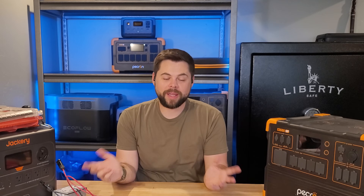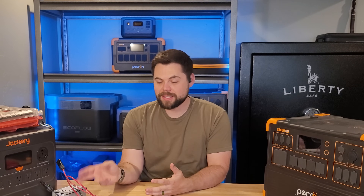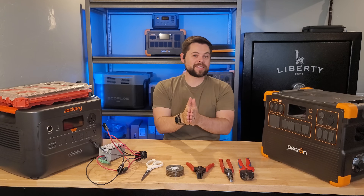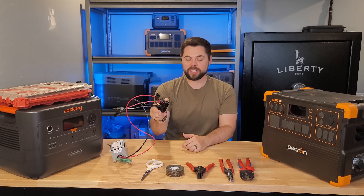This video is not sponsored in any way. If you use the links in the description below, you'll get coupons and discounts on the EMP Shields — those are affiliate links that also help out the channel. The exception to all of this is units like the Jackery, which use a proprietary 8mm barrel connector. Because the positive and negative cannot be physically separated in that cable, this method will not work for those units. If that's the case, your only option is to put it inside a Faraday bag and not be using it when the EMP goes off.